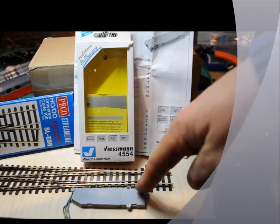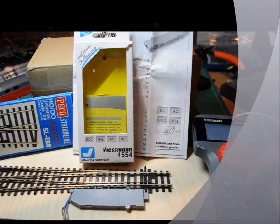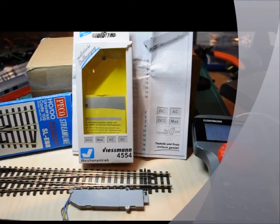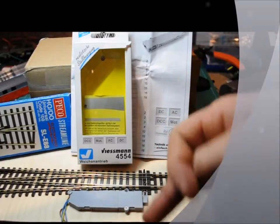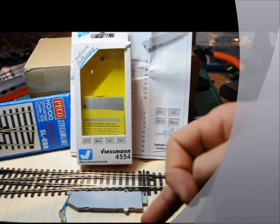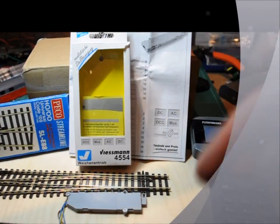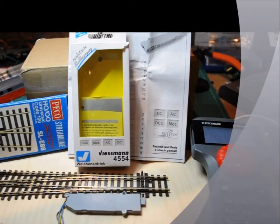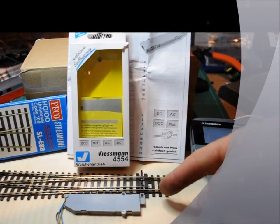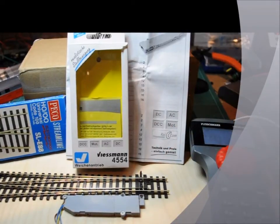As you can see here, I've rigged it up and side-mounted it to the point motor. If I press 22 it flicks it off. What the point motor actually does is it pulls it past centre, then the mechanism goes back in a bit, so when it's ready to push it the other way it's close again. Then you push it the other way and across it goes — it does the opposite as well, pulling back off it slightly to take the pressure off the motor.